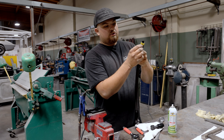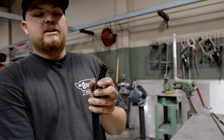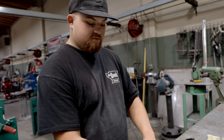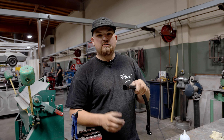The tape — when I take it off, the fibers aren't going to fray out like they normally would if you just cut them on the bandsaw without tape. Once again, just a little bit of spray on the inside of the fitting helps it go on. One thing I didn't mention: you want to twist the fittings on — don't try to push. That'll also fray out the fibers.